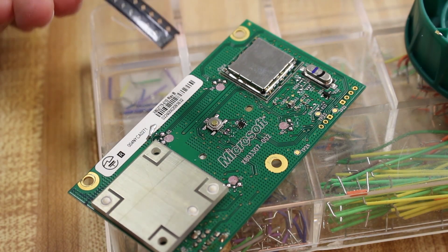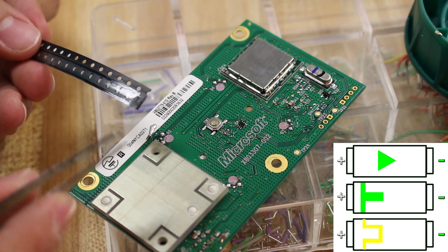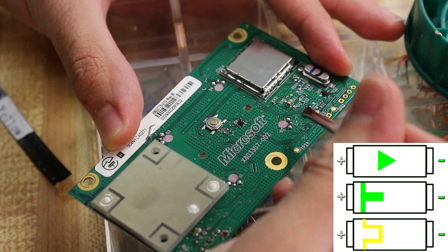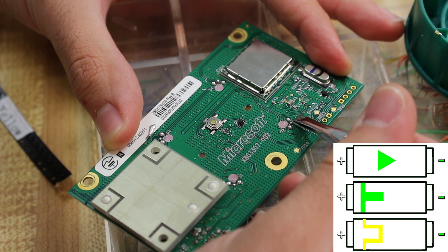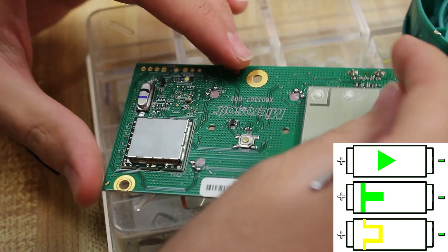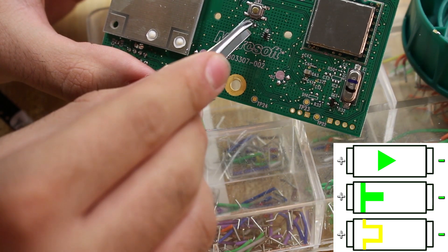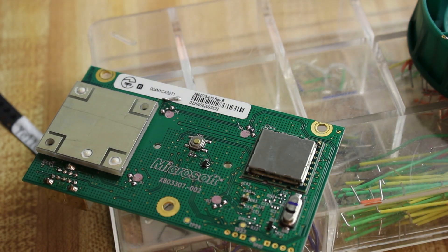An issue you might run into when you have these LEDs on hand is how to put them in. I'm going to put a diagram on screen, but on the bottom of these LEDs there is a green triangle, and wherever the green triangle is pointing, that is where the negative is. Now on each of these points, when you are facing them, they go positive, negative, negative. So you need to put the positive end at the positive point and the negative LED at the middle negative points for them to work out. It's like that on every single one - the triangle formation I like to call it. The LED in the middle is just going to be positive and negative.